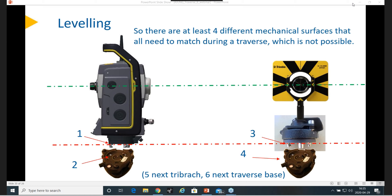What is the maximum distance you should be measuring with an EDM using a total station? We have more or less uber capacity on the EDMs today. The spec says five kilometers. I have tried to measure it and you barely see your target — you have to do manual aiming as the tracker won't see it. I think most people do GPS on these really long baselines today. That was back in the old days when we were doing traverse with long legs. Today, I can't really see too many people doing that.